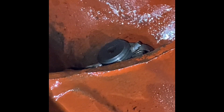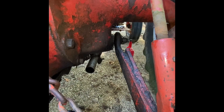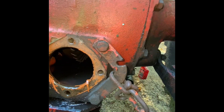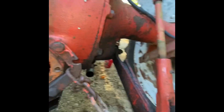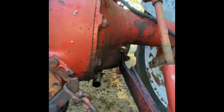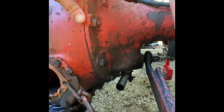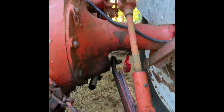There's the inside nut — it's a castle nut with a cotter pin on it. I think I'm just going to go ahead and put the new PTO shaft in, because if it leaks bad enough I'm going to have to take this whole side off anyway. I tried to reach in there but all I did was cover my whole arm in hydraulic fluid. Maybe it doesn't leak too bad though — it's been sitting eight to ten years so maybe it's a slow leak. If not, I'll have to take the whole tire, fender, axle, and all off just to get to it.